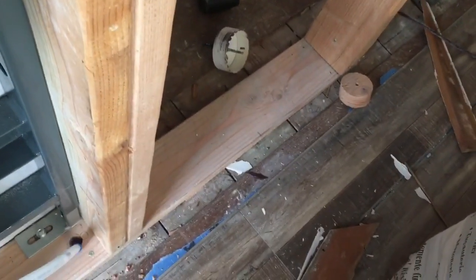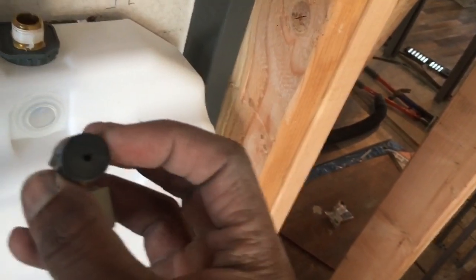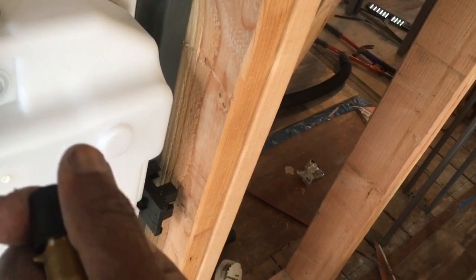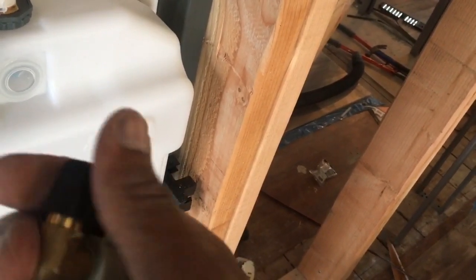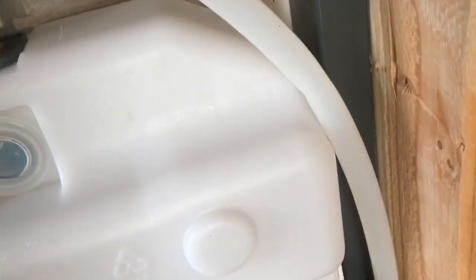This is a 7/8 inch hole, a 3/4 inch hole for the 1/2 inch pipe. And up top here, I have this little connection PEX here. This is Apollo PEX, which is supposed to be the expansion type. I'm gonna see if I can get it to work with my O-ring clamps. Alright, let me get this off. So, PEX coming up here. I don't really like this PEX. I think I had PEX B that I got from a supply warehouse, and it bends perfectly. Don't worry about the kink or anything there. So I want to cut probably about here. Get that going there.